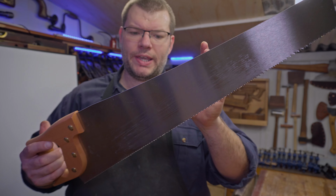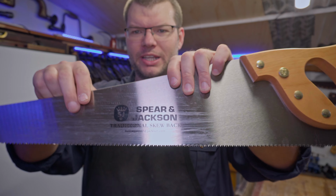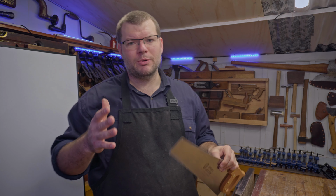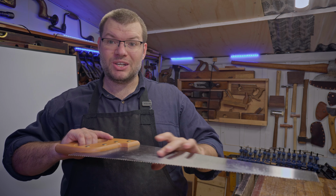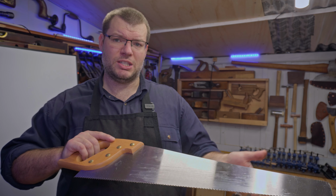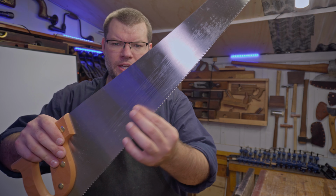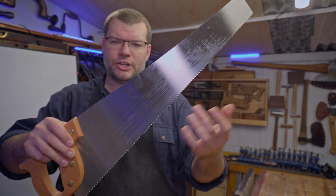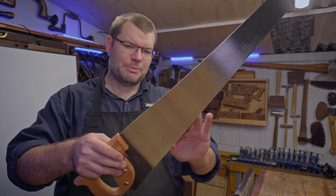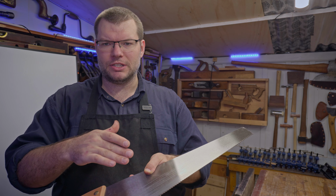The first reason why you really want to remove that coating is, all you have to do is take a look at the saw plate here. You see all these streak marks and everything here. Now, the problem with that is that the finish they put on there to prevent the rust while it's in storage before it's used creates friction. And so it's gaining extra friction on the saw plate and partially rubbing and grabbing some of the sawdust and some of the wood and embedding it into the surface of the saw.